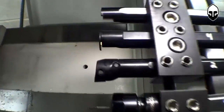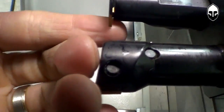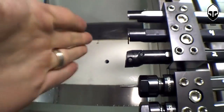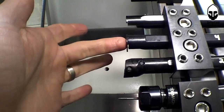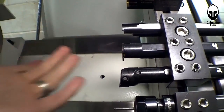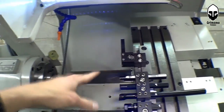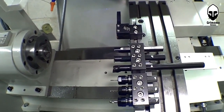When in doubt, I could change my plan up a little bit — no big deal. I had a square insert here and this one has a little taper to it, and the taper will just cut off the part better. I could put a square one in here and do all my turning with just this tool so that I only need one, not two. But I'm going to try to just put another insert in there, check my offsets, make sure everything's still zeroed, and then go again.